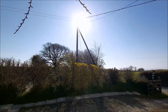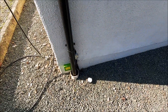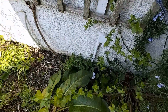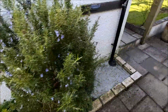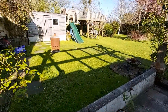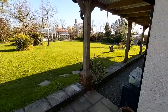It's made a significant improvement. I've also put a rod down there for the garage — it's all connected together. The more contact area you can get with the ground, the better the earth conductor is going to be. Just a quick one, but it's made a difference.